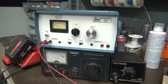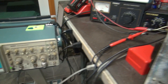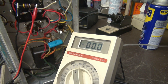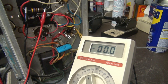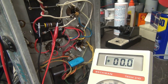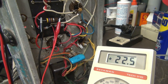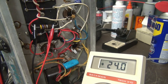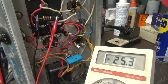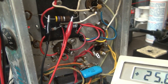Time to fire the amp up. I've got it into the D-Lab audio test set, with a scope monitoring and the bias measured across the bias resistor with a meter. Just plugged her in — we'll see what that bias is. I did measure this resistor — it's supposed to be a 470 ohm, but it's up to about 540. So more than likely that resistor is toast, because once they start changing value they keep changing value, especially these old 10% ones. So more than likely he's coming out.